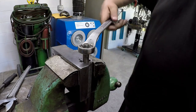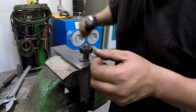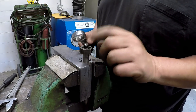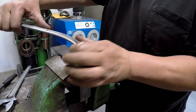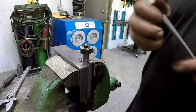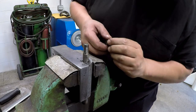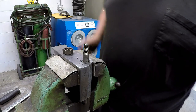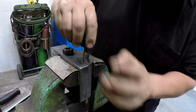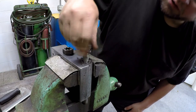I don't know why it was beaten on the end the way it was — the proper way to remove this pin is to back the nut off and then tap the end of the nut, not the end of the thread. All right, let's back it off — I think we finally got it now. There's our new nut. Just like it was made for it — a perfect fit right there.